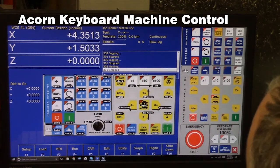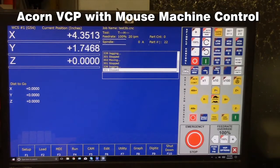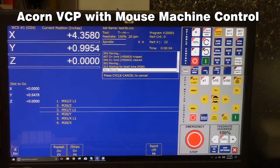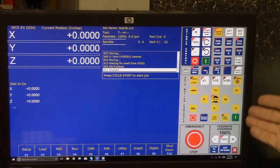So that's using the keyboard. To get out of this screen we do Alt+J. Let's just use the mouse on the virtual control panel. We're in slow mode — here's Y, X, there's Z. Bring it down, go to tool check, send Z home. There's your cycle start button; if you want to go into single block mode you can do that here. If you need to stop the program you can do it here. Here are your auxiliary buttons if you have them programmed. If you want to reset home you can do that here. You can hear my machine going to its home position. I hope you find this video useful, thank you.